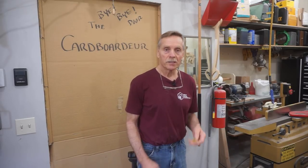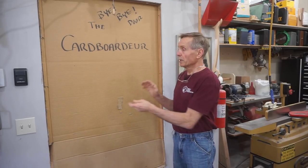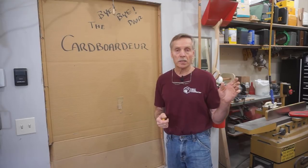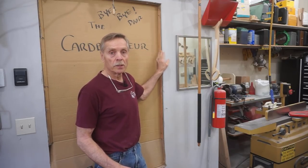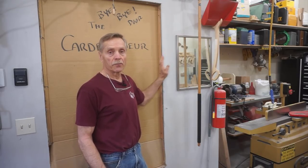While that CA glue is setting up, I'm going to tackle the embarrassing part of this install: making this rough opening wider. From a previous episode, I made this opening for an exterior style door jamb with regular hinges and there's a half inch shim space on each side. But because I made this door jamb extra thick and a little bit wide because I'm using invisible hinges, I've got to increase the opening size. Since it's a non-structural wall, I'm going to take out the inch and a half trimmer stud or cripple and replace it with a three-quarter inch one — that extra three quarters of an inch will give me enough room to install the frame.